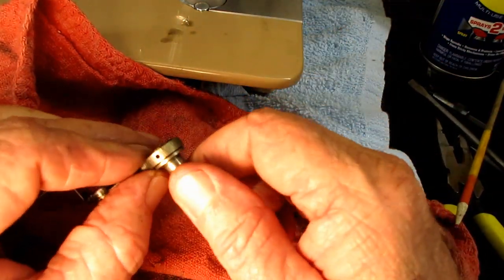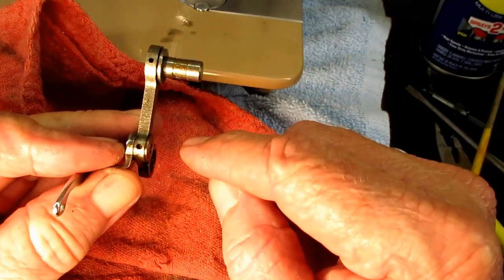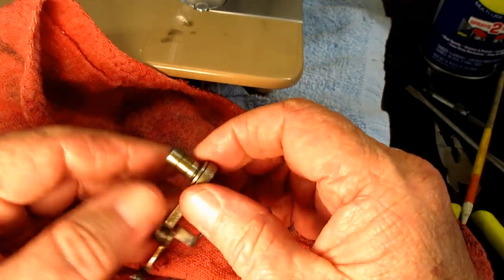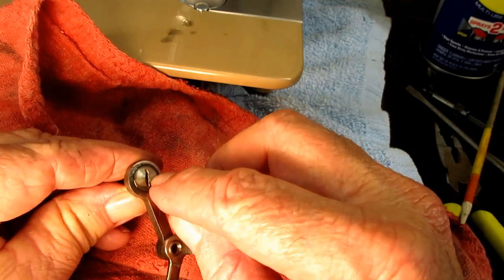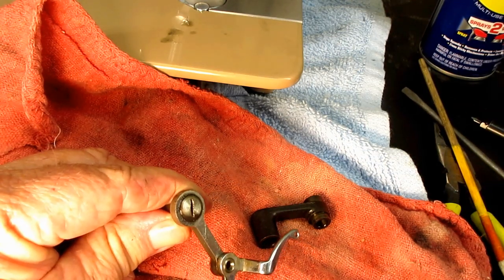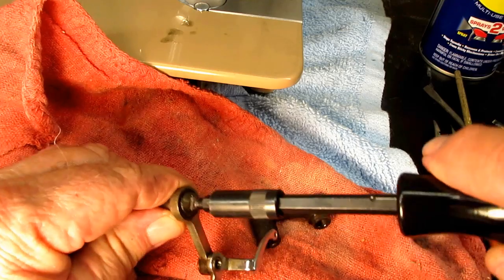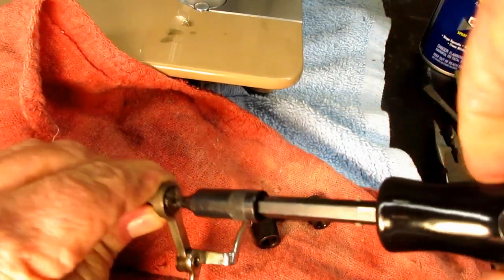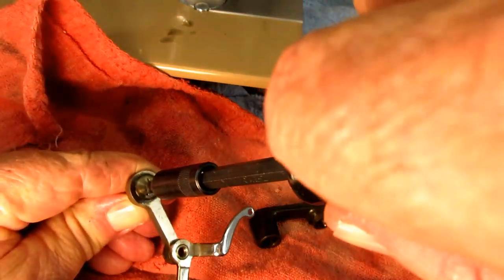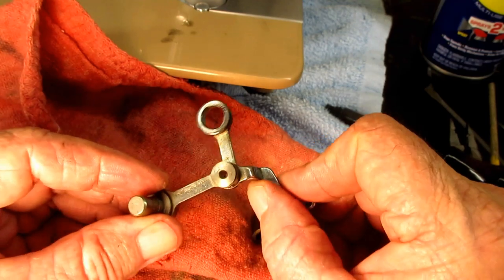This one will not come apart — you can see the little oil places for it — unless you put the screwdriver on it and turn it to the right. Like I said, I don't do that anymore because the head of that screw is just so thin it's not worth it. Since I have an ultrasonic cleaner I'm going to throw it in there for 10 or 20 minutes, then use a steel brush if I need to get anything else off.